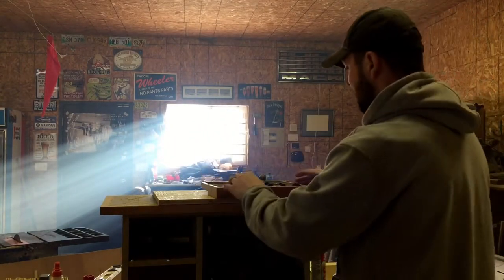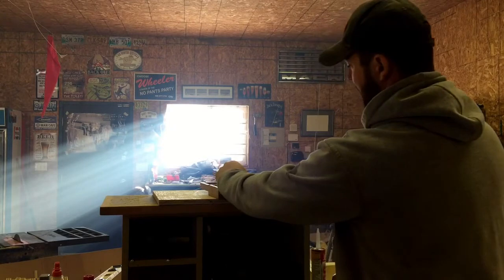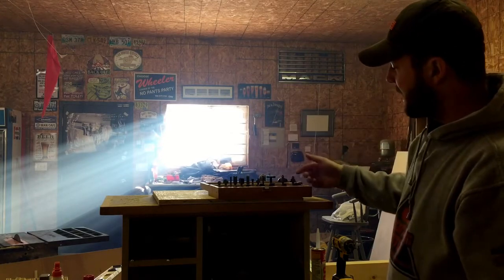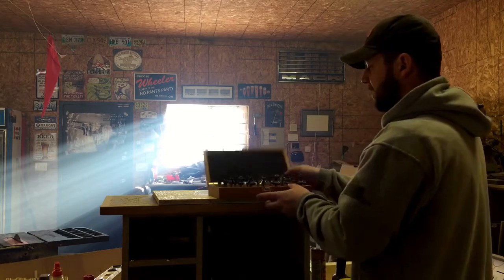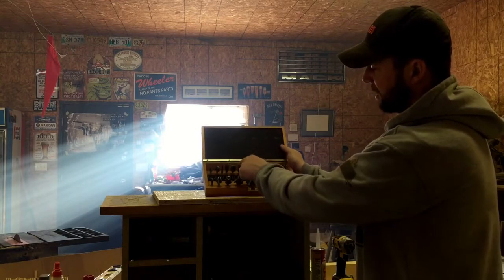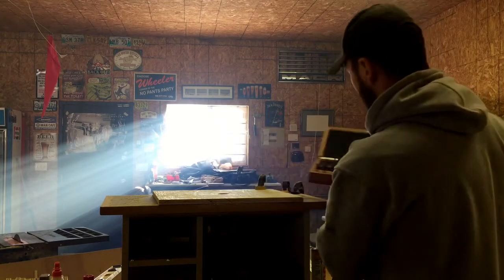I was able to drop that down. So I started off with either one of these types of bits, so that you can actually punch down and in — it's just basically a half-inch or three-quarter bit, punch it down. And then to create some clearance, I used the biggest bit that I could find. I have this one, which is a 45-degree angle bit — it's nice and wide. Starting with this bit, I was able to clear the bearing on the top and then plunge down and actually get that whole piece.